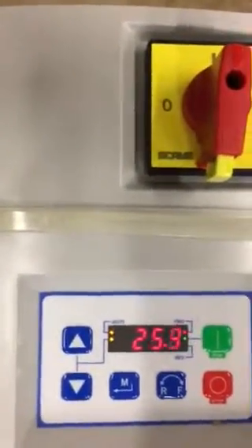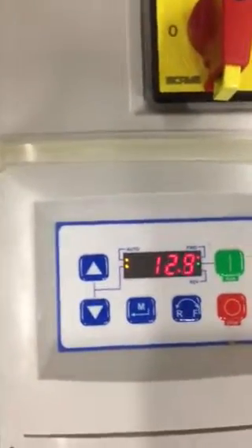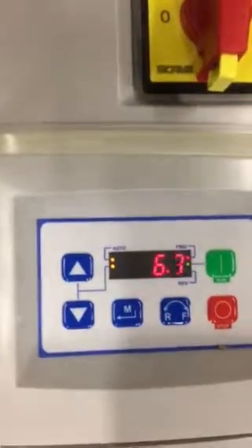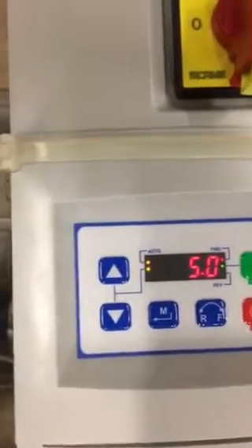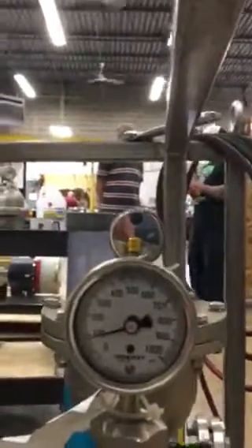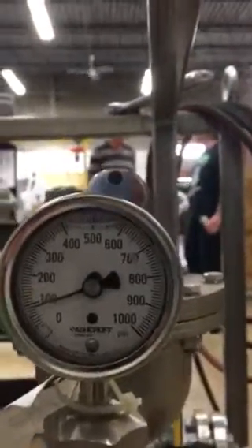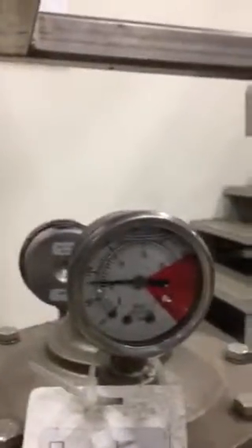We can program the rate of speed at which this VFD drops. You can hear the VFD slowing down — it's just gone to sleep right now. It's in sleep mode. We can take a look at our pressure. We can see we've stabilized at — we set it for 80 or 85 and 80 — and we're darn near close to that. It's not perfect; that might be 80. We can see that the pressure on the suction accumulator matches that.